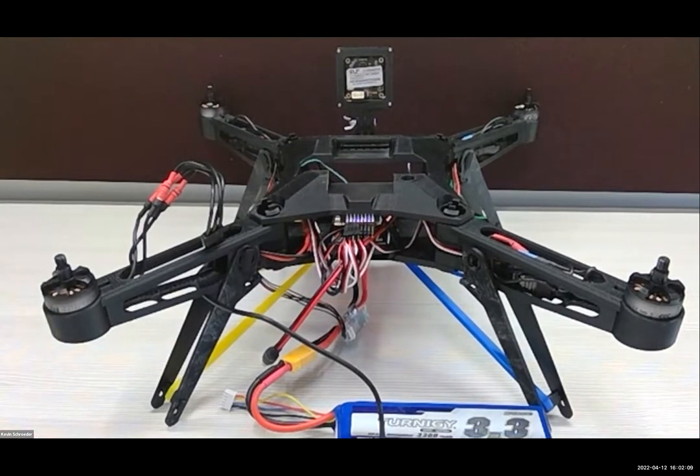It's just that easy to get everything operating on your drone. There are a few more settings you can play with and tune. You can set it to various modes and make sure that the drone reacts without propellers — pick up your drone, put it in a stabilization mode, and see if your motors are all trying to compensate. Add a little bit of pitch or roll and make sure everything's good. I feel pretty confident letting you guys go, and I will follow up in a separate video about how to do your calibration for your drone.